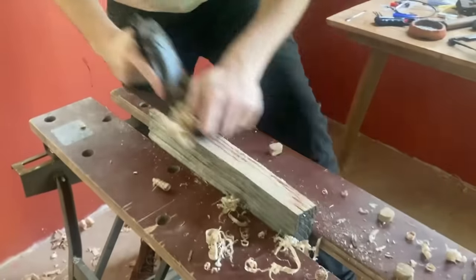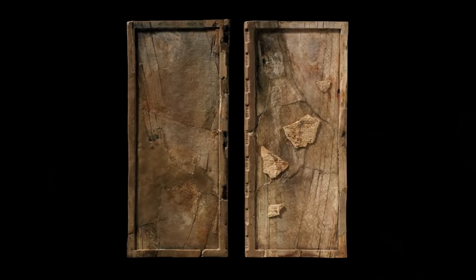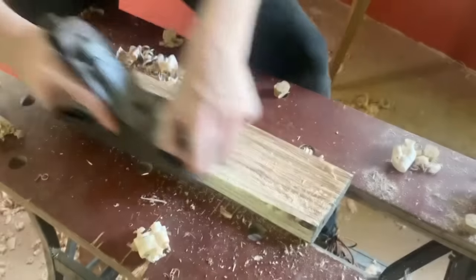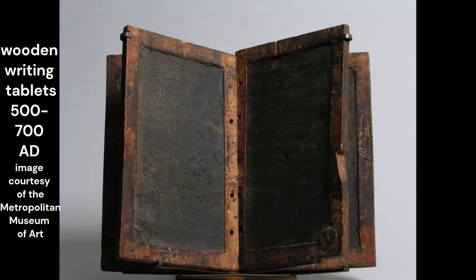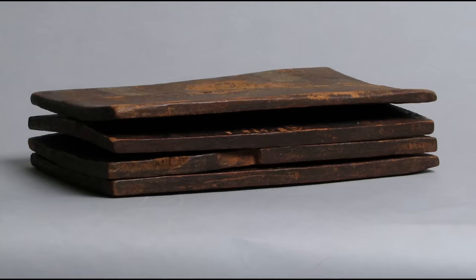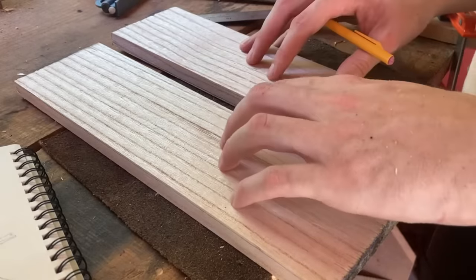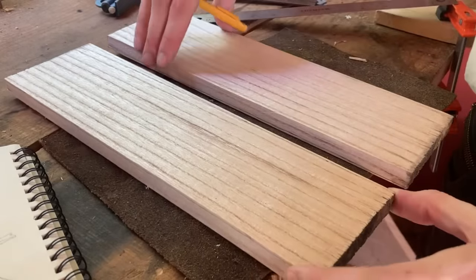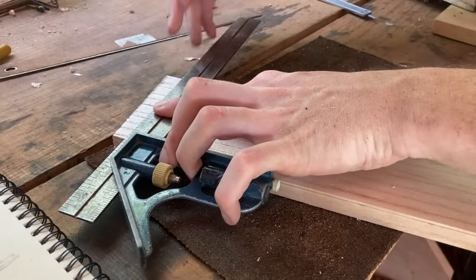Most are made of wood, which is where I'll start with mine. However, many are also made of ivory, like the Assyrian one from Irving Finkel's lecture. Rather than making one particular artifact, I'm going to combine elements from a few. My primary inspiration comes from these Coptic examples from Egypt during the Byzantine period. Though this artifact has multiple tablets, I'm going to just make a pair, known as a diptych in Greek, which is the more common style. I'm going to plane the wood down to about half an inch thick to match the Coptic tablets, and then carve out shallow trays to cast molten wax into. Once the wax solidifies, it will be the writing surface that the user can inscribe with a stylus.